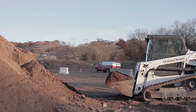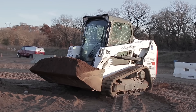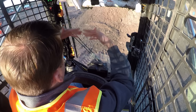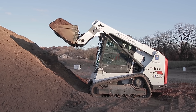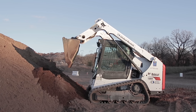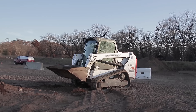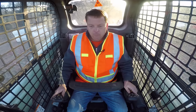Once I have it, I'm going to back up. The key is don't keep pulling up on this. With this machine there is no auto-level — what I mean is, sometimes when you pull back on the right hand, the bucket will uncurl a little bit to keep it level, but this one does not. That means the material can come right over the back, right over your cab, which is not great for a new operator. Keep it low and tight — I'm down below me. I'll bring it over a little bit, then to dump it just go right hand back. Visibility in a skid steer can be a little bit more difficult because you've got the arms on both sides, so a rear view camera or mirror is helpful.